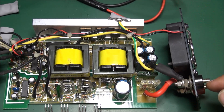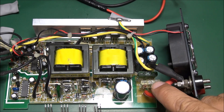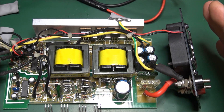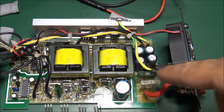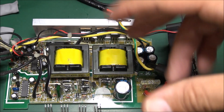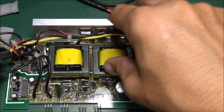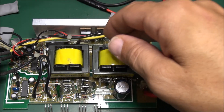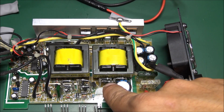You can see here the input, which has a very big cable because this kind of device uses lots of current. Here you see the fuse, which is huge too, because this device uses lots of current to provide 500 watts RMS output. The DC input comes from here to this capacitor, which provides a stable value to these MOSFETs — there are four of them — and they work like a switching power supply to give a square signal to this coil.